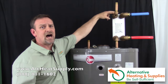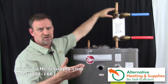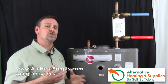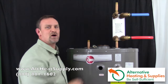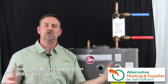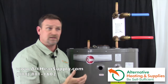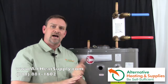Another common question is: do you heat the domestic hot water first or the boiler and hot air furnace first? The answer is you're always going to go to the domestic hot water first. The reason is if you're taking a shower and you get a couple degree difference, you're going to know immediately — and if your wife gets it, you're going to hear about it. So make sure you go to the domestic hot water first. When you go to your boiler after this, if the house temperature is off a degree, you won't even notice in the hot air system. Once you're done with the shower, the wood boiler or any other boiler system will catch up and get the hot air system.